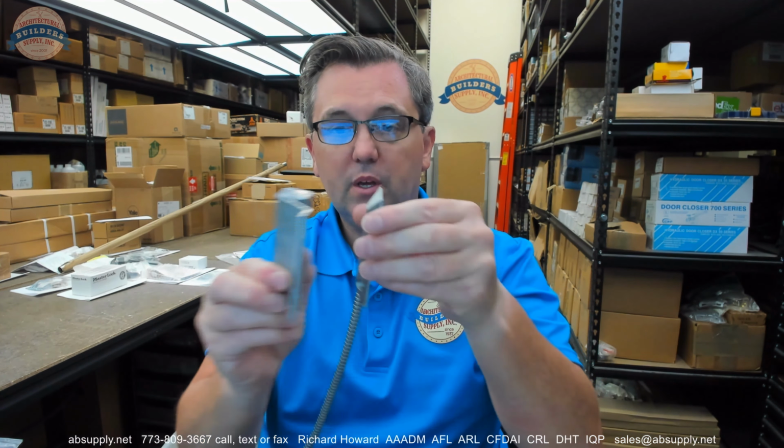You may want to have current flowing through. You may want it to be normally open such that when the door is closed you have no current flowing through. But when the door is open, now the circuit is closed, allowing an annunciator, a buzzer, some sort of bell to ring, so that when the door is open, there is some sort of thing happening that will tell whomever that the door is open. So you can easily do that with a normally open or normally closed condition.